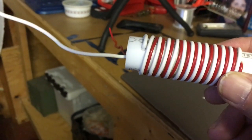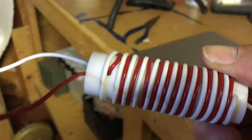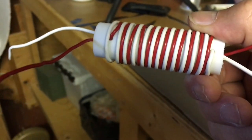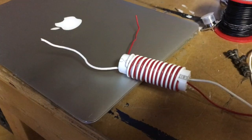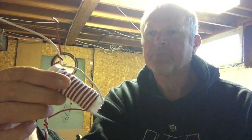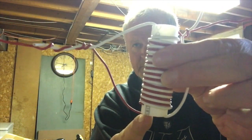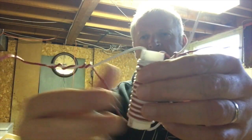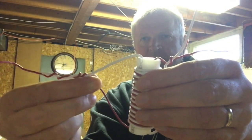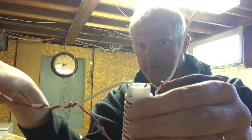What I did here was drill a couple of holes on each end there, which just helps to hold the wire and keep it taut, so it turns out quite nice. So this is the way it works: the bottom of one attaches to the end of the other — the top part right there. And this is going to be grounded, so it's going to go to the shield of the coax and it's also going to attach to the counterpoise of the vertical antenna.